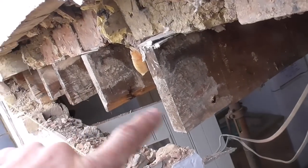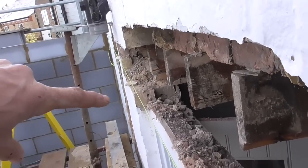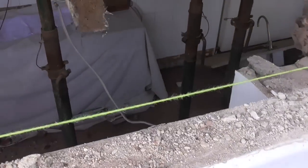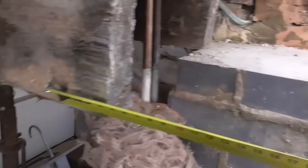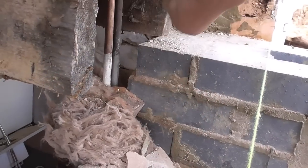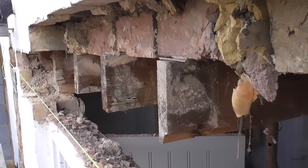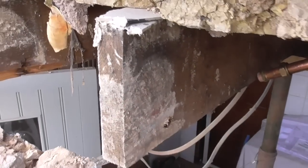What I need to do is get a nice straight line to cut these old joists off. What I've done is strung a line down the outside of the house. Basically we've gone to the joist which has been cut back the furthest — it measures 190mm from this joist to this line. So all I need to do is measure back 190mm, put a mark, use a little boat level to level that up, and then cut. I've got a pencil mark there, 190mm back from this line each time, so we know those joists will be cut off nice and straight. Then we can offer the steel in and it'll butt to that nice straight line, and we can wrap the joist hangers on them.